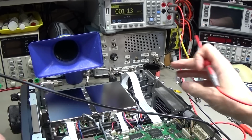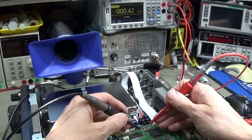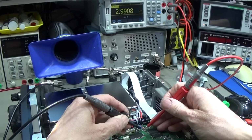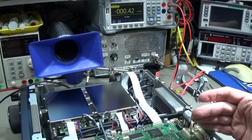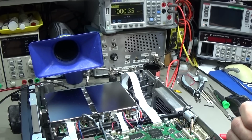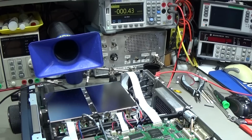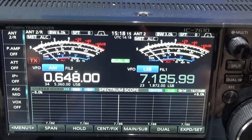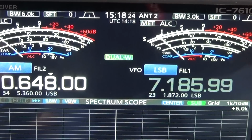Okay, so let's test. I mean, the battery which is in is a used one, so that is not crisp new, but anyways, we should see that the polarity is right, 2.99, so you see it is working, our circuit, and you see that we have another little voltage drop of 10 millivolt, so that is showing everything is working, and yeah, it is ready to go. Our project is finished, and you see everything is nice. Alright, so the radio is working, and as you can see, the time has set now to the original time we have here, and everything is fine, ready.